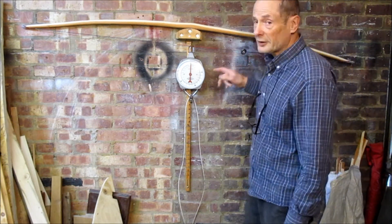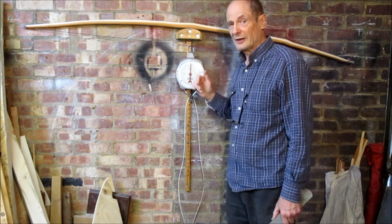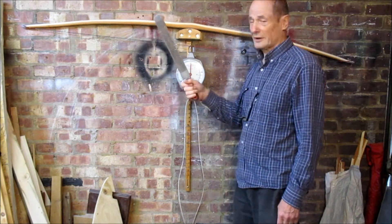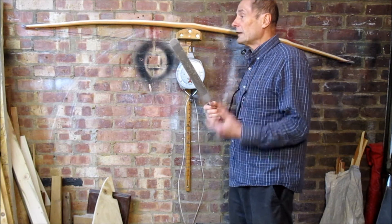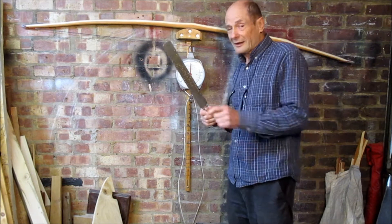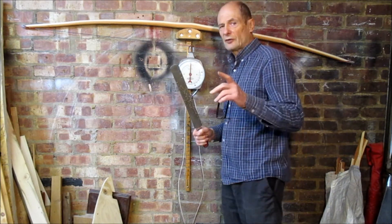So I left it braced and set to work taking a good bit off the belly on the upper limb — I'll take some more off the other one later. I used a farrier's rasp, which is quite a vicious tool that takes off a decent amount of wood fairly quickly. I did the sums and it looks like it's about 128 pounds, so if I want to go down to 100 I've got to take about 30 pounds of draw weight off. I'm not going to fiddle around — get stuck in with a big rasp but keep checking. Make haste slowly, grasshopper. It's that balance.